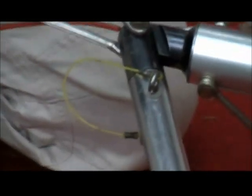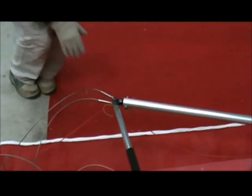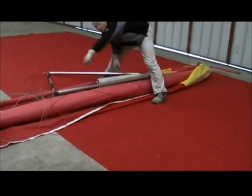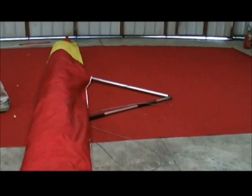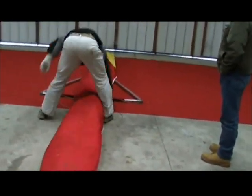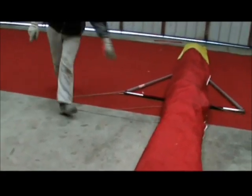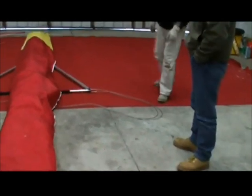The next thing is to turn the wing over. You see people struggling in all sorts of weird and wonderful ways, but there's no need. You turn the A-frame so one upright runs down the heel, then using the other upright you lever the wing, the bag, and everything over — like that. Then you sort the wires out so it's nice and tidy: side wires laid out like so.